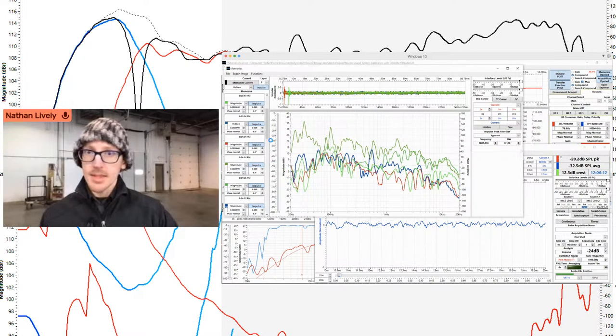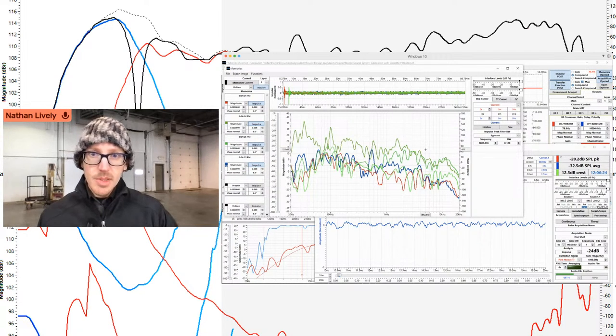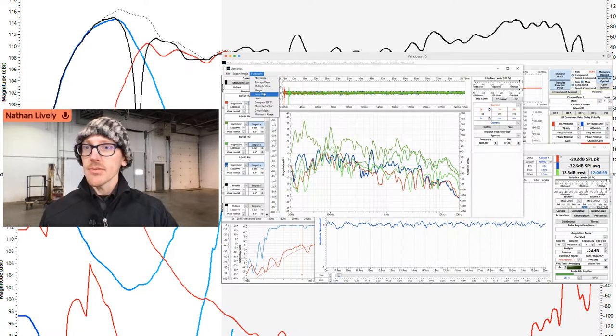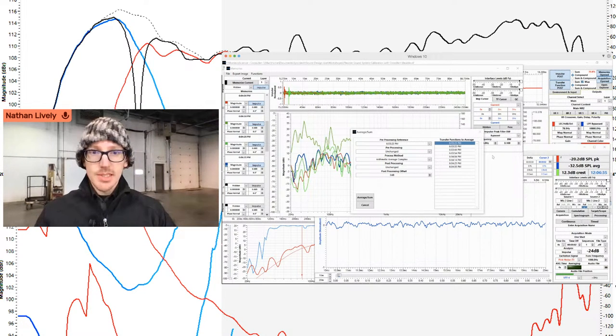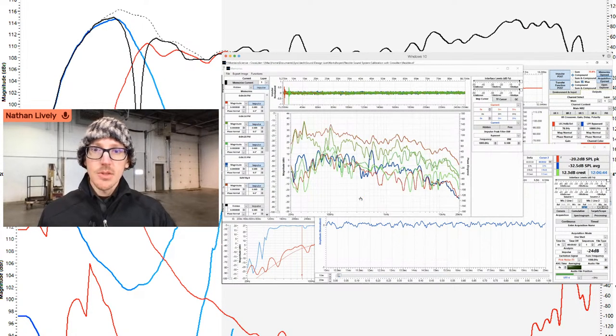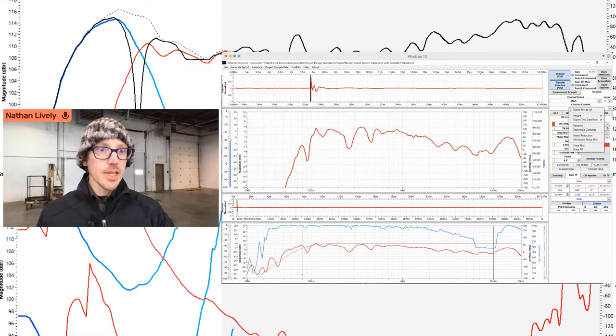Okay, just going through these. And that's all of them. So now what I can do is quickly create an average. We have all these different functions that we can apply here. One of the easiest is just to get a quick decibel average without worrying too much about the phase or doing any kind of alignment. So we do an average, close this out, and then I can import that average into my channel here.